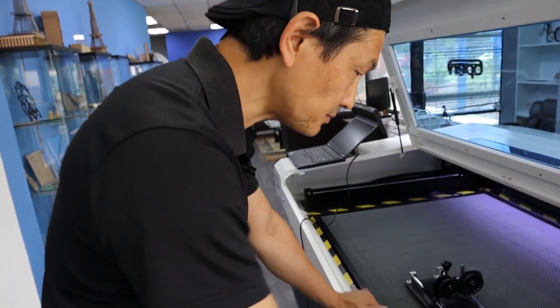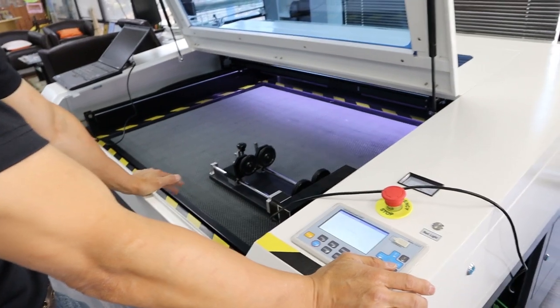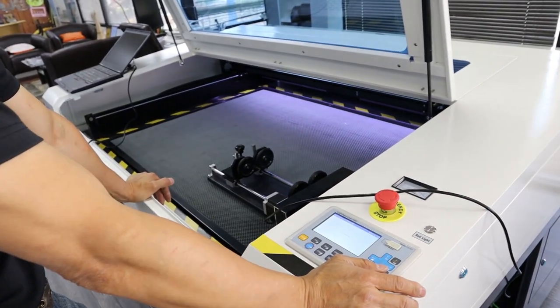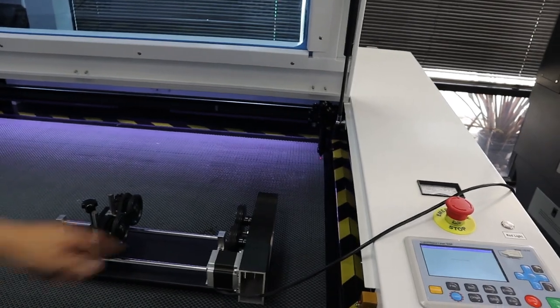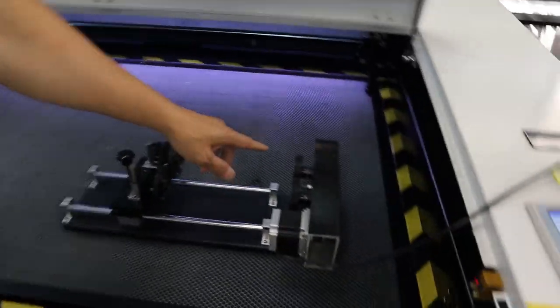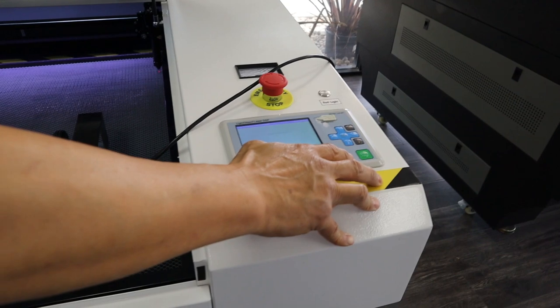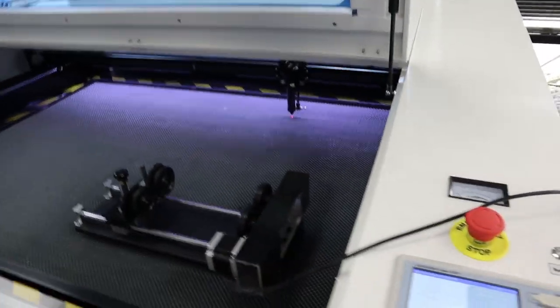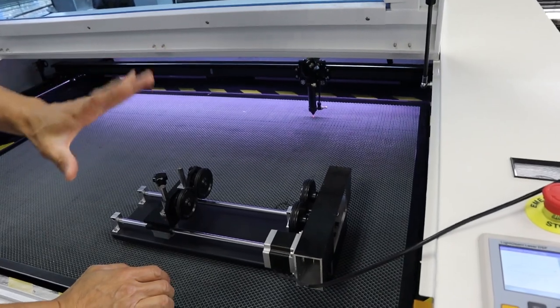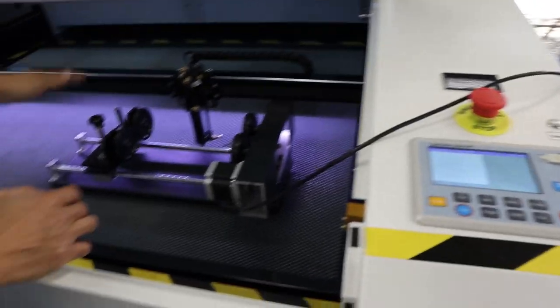After stopping, we move the X, close it. Because Y is disabled, we have to manually move the Y gantry to position over the rotary. However, the rotary is too high, so we have to drop the Z table down.